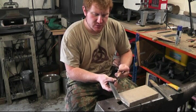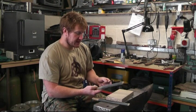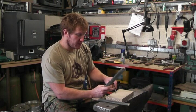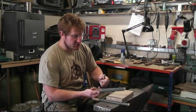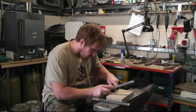And now we're ready for the next stage which will be the stropping. So what we're going to do now is we're going to show you the technique of stropping the tool. We've charged up our leather strop and I normally start on the outside bevel again. So we're going to use the flat side of our strop, placing it back on our little wooden block, stropping away from the cutting edge.